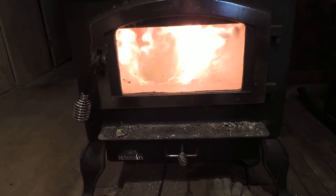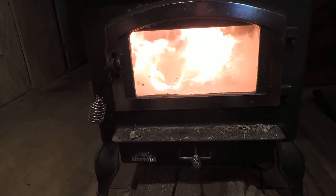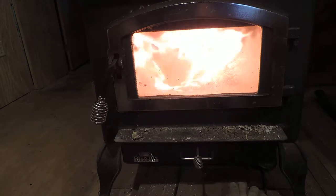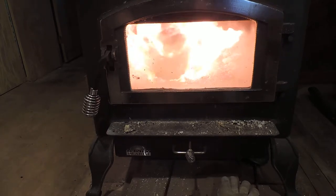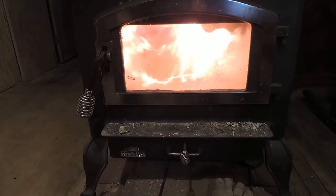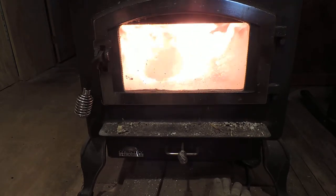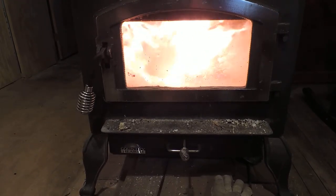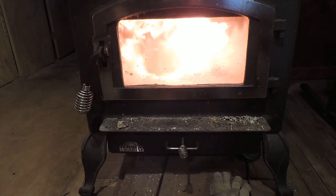That's what's happening now, and hopefully this will help clean out any kind of buildup, soften any creosote, and then when I burn another fire it'll just drop as ash. Just a little tip that seems to help the safety and efficiency of the stove. It's not all that expensive, and how often you do it depends on how much wood you burn, where you live, and how big your stove is. For me, twice a year seems to work, and that's what I'm doing today. Thank you for watching — please subscribe to our channel.